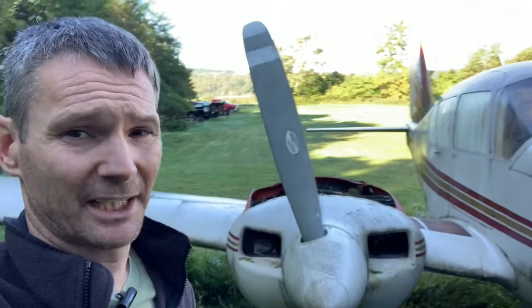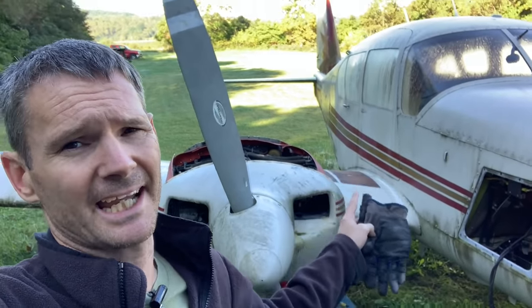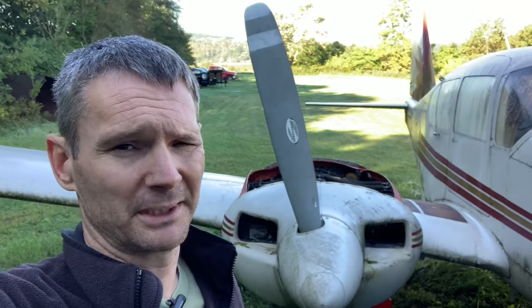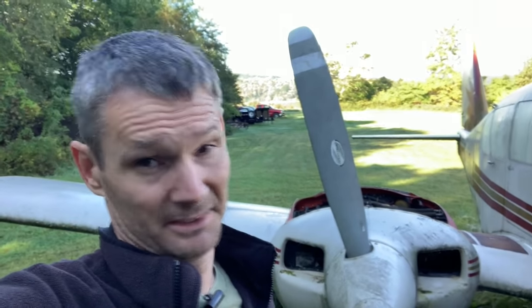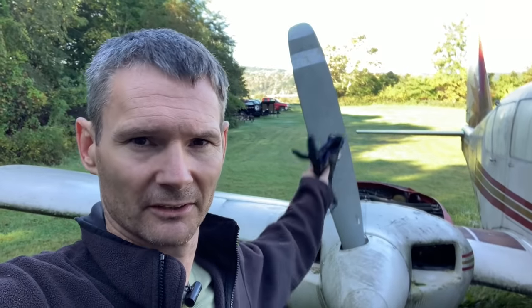I just got off the phone with Jack, and he said, oh, I just remembered something. There's a switch under the dash in the airplane that you have to switch to ground the P-leads out. He put that in there so nobody would steal the plane. Well, it worked, although all you got to do is just pop the P-leads off, and then it starts right up anyways. But there was a switch under there this whole time that he forgot about and just now remembered. All we had to do yesterday was flip the switch, and it probably would have started right up without all of this other hassle of switching mags and going back and forth and doing all this craziness.